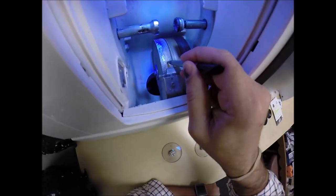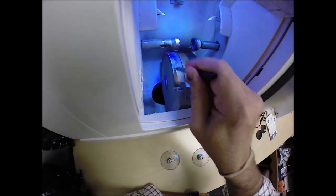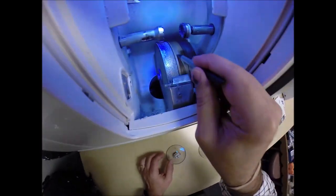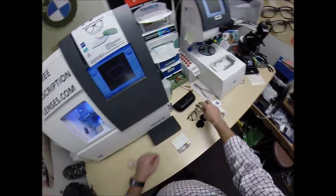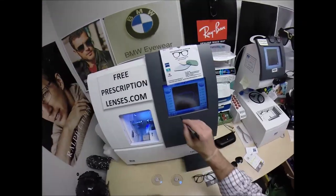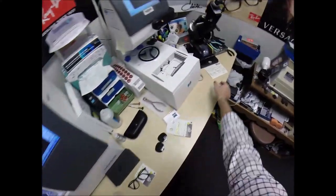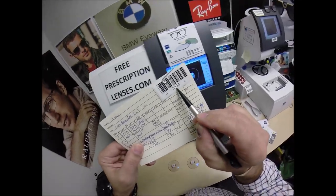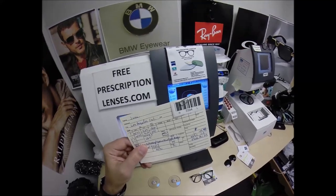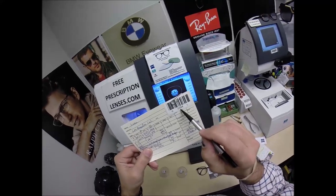This is the cutting wheel — the diamond-crusted wheel that's going to grind away your lens material until it's the final size. There's a V-shaped bevel in the center that's going to put the V-shaped bevel on the lens so it stays inside the bevel of the frame. I'm going to wake up the computer — it is job ID number 3394, installment 3394 of my 330 million volume series of making a pair of glasses for everyone in America. So I'm at 0.01% of the way there.